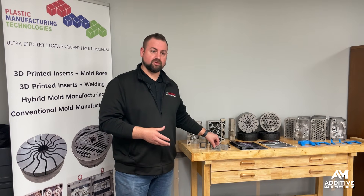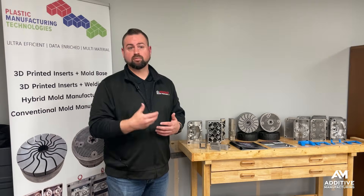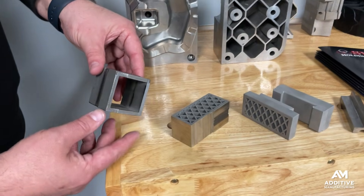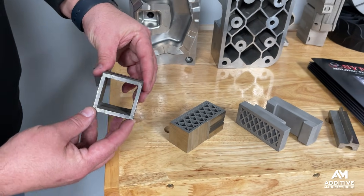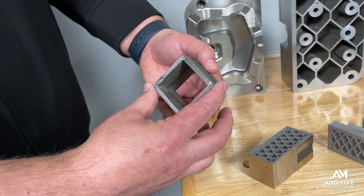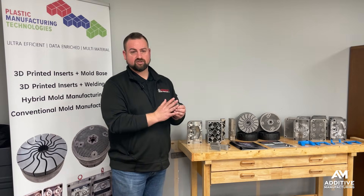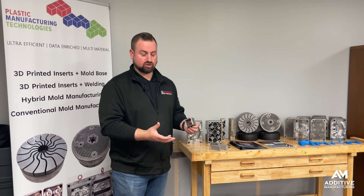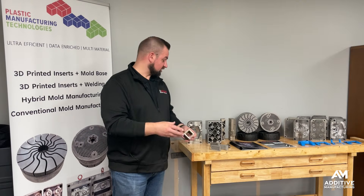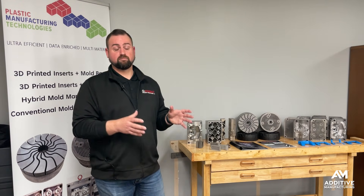"Conventional welding would not allow us to print such thin-wall pieces and join them together, since there's a dramatically higher amount of heat input into the substrates. You can see here — the sample was laser clad all the way around. It's 17-4 stainless steel clad with 420 stainless, and there's a five-millimeter wall thickness with zero warp or distortion. Two 90-degree faces joined together with no mechanical joining feature — a great example of the elimination of that heat concern. This complete offering eliminates the build box limitations."